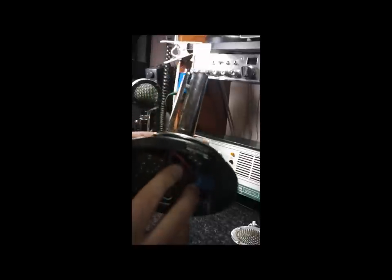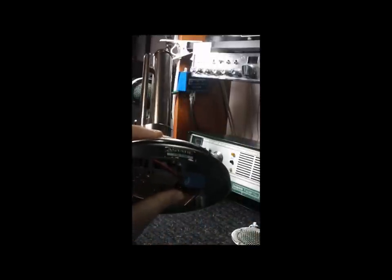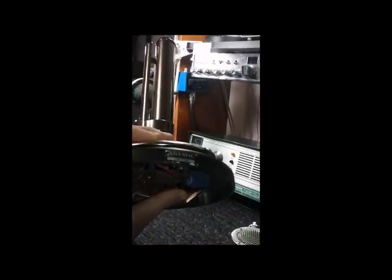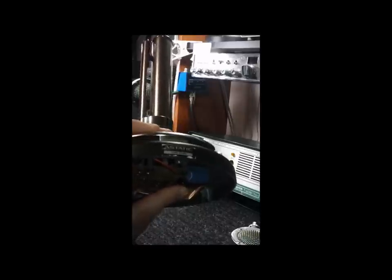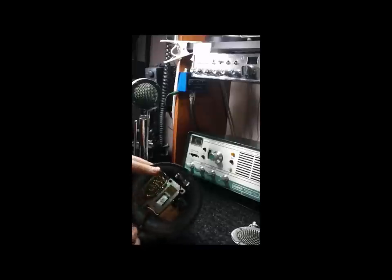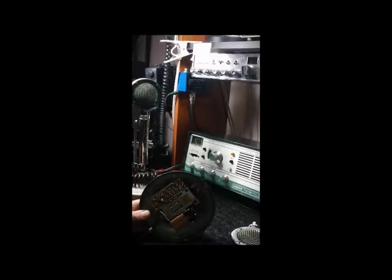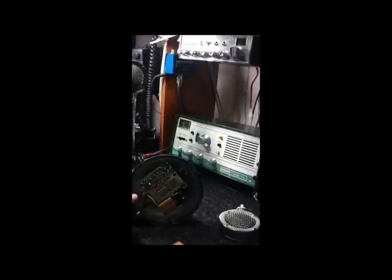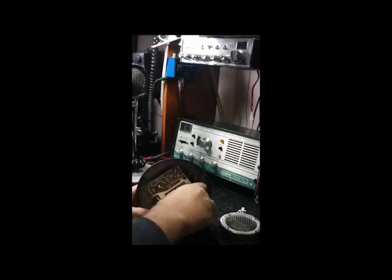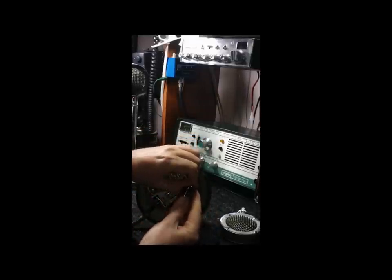This is what these look like. In here — I don't know if you can see that — there's a relay right in there. Notice when I push down on the lazy bar, you see the little white plastic piece; it's making the relay make contact in there. So to get to this it'd be best if we let me tilt the camera down a little bit and remove the battery. People get rough with these and if you get rough with them you'll tear them up.